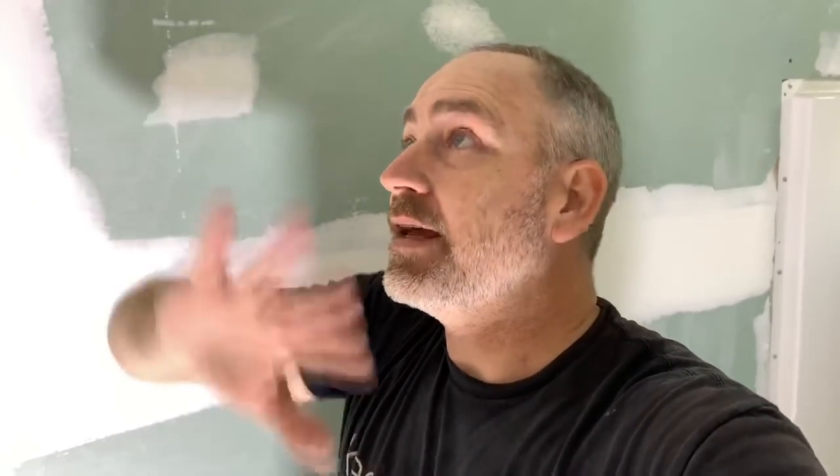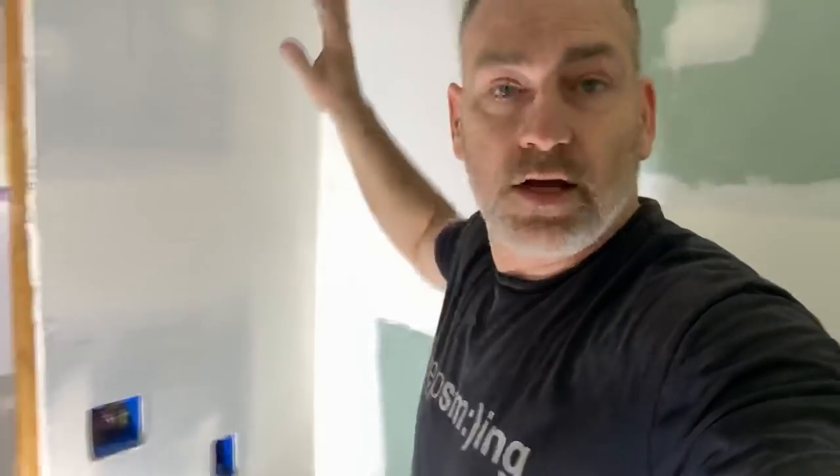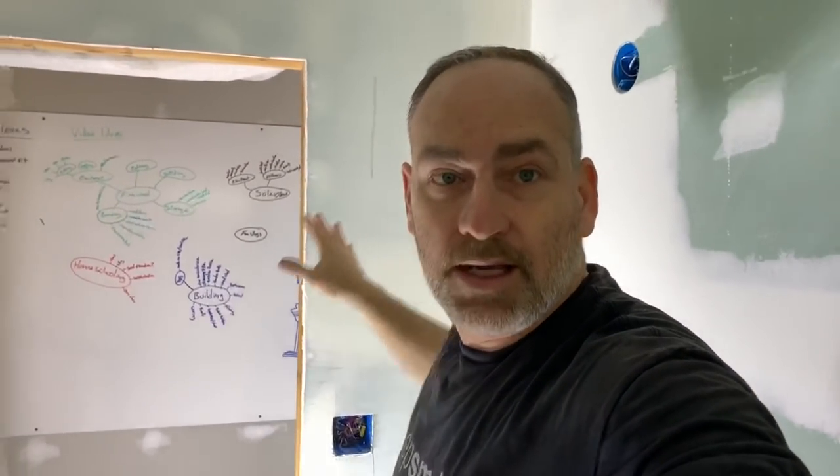I think I'm getting the hang of this stuff, guys. Look at that — so smooth. There's a little bit of texturing right there, but it's way better. I think the clue here is you've got to put it on thick enough — as in, get enough on the wall that you can actually smooth it out. There wasn't enough on the wall here. So we'll go ahead, reapply to this side, and try to get it done better. Let's go ahead and try this again.